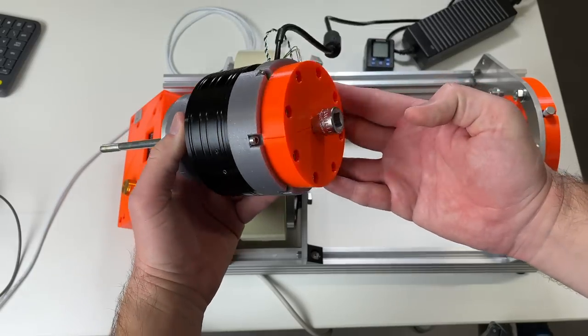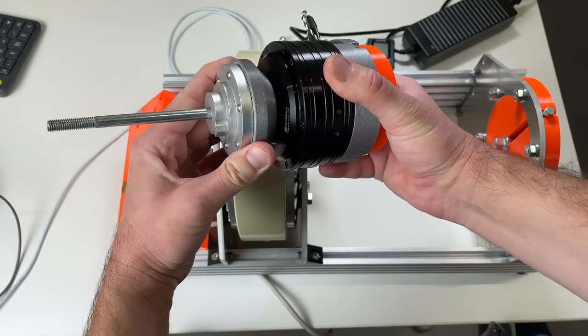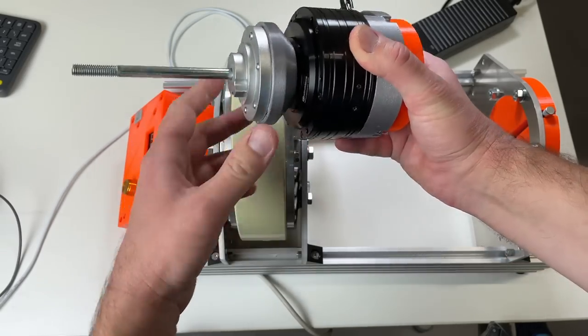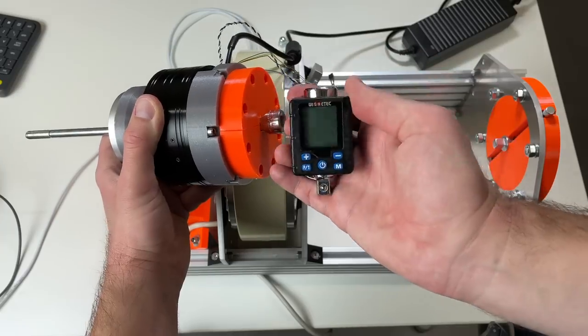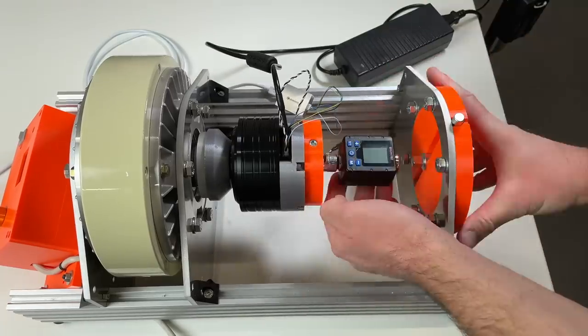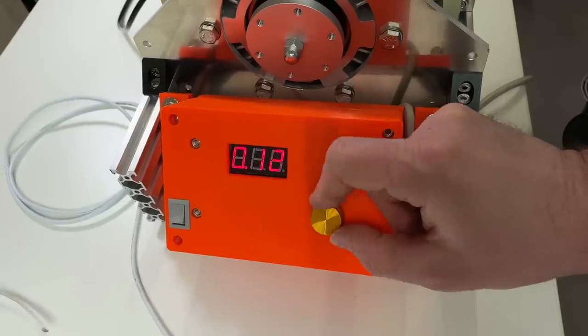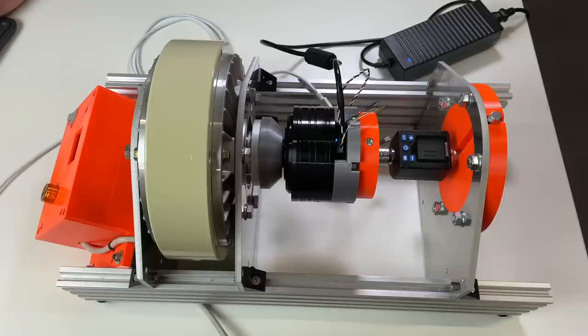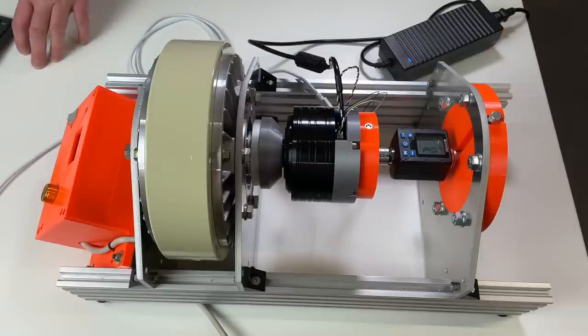The actuator I have installed over here. So this is the output shaft, which will go to the input shaft of the brake. And this part will be fixed using this torque meter. It's not really a precise device, but it's good enough. So this is the servo mode. Let's increase the current to 0.3, go to 360. 18 Newton meters, go to zero.